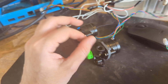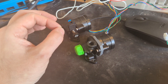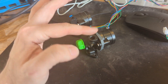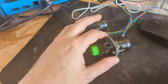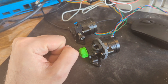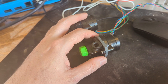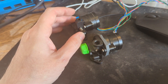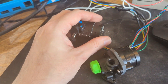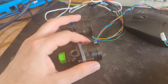Note that for these tests I was using a TMC5160 at 48 volts. I don't think 48 volts really matters — at 24 volts I don't think you reach the speed limit with either extruder. I was running 256 microstepping, interpolate off, and 0.7 amps for the tests. The Galileo 2 instructions recommend 0.6 amps and the Orbiter 2 recommends 0.85, which I think is too toasty. I went 0.7, which may even still be too toasty.